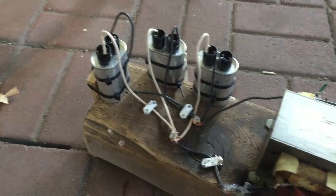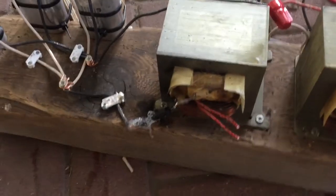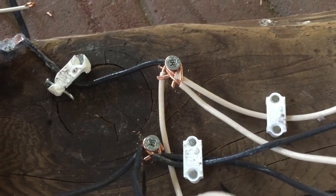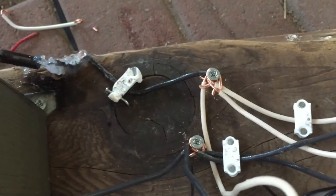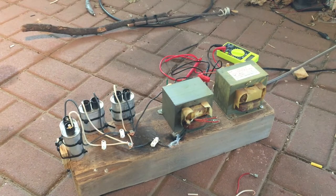So here I am about three hours later and I have it all assembled on this nice piece of wood. Here's the outlet that I'm using — it's even got a little glowy part. It's just so I can keep everything together and tidy the wiring up. I'll show the back. I've employed a rather interesting system of mounting the capacitors because I don't have the original mounting brackets. For now, I just have two separate AC lines going in. I also used some Romex staples — and just like in real life, it's always a one in three failure rate; these nails always screw up and make a mess. I'm charging up my novelty shocker before we fire it off one more time before I end the video. I put some silicone grease there because it was having some arcing issues from the diode to the outside of the transformer.